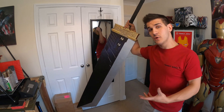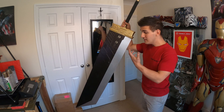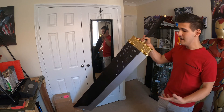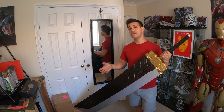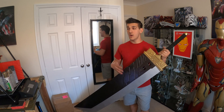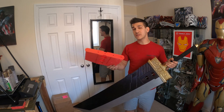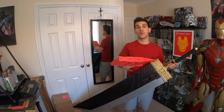That pretty much does it for this build review, guys. If you watched all my other tutorials on PLA fusing, PLA welding, and sanding, you'll know how to make this. It's really as simple as printing out the parts, fusing them together, painting it, and calling it a day. I actually had everything printed in about two days; however, it just took me a lot more time to fuse it and get it how I wanted. The only problems I really had were gaps when fusing the parts together — I had a little bit of lifting on some of the prints, so the nice, smooth, flat surfaces didn't really meet up too well. I had to do a lot of welding and filling, but I was actually able to utilize all the leftover raft material to melt right into the blade itself. When printing something tall like this, I'll always use a raft to give it a little bit more stability. Also, you can print these pretty quickly as long as you orient them in the X axis, so your nozzle does more of the work instead of your bed.